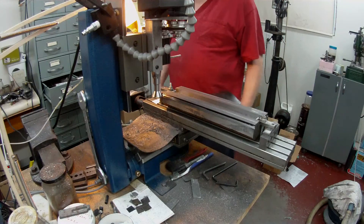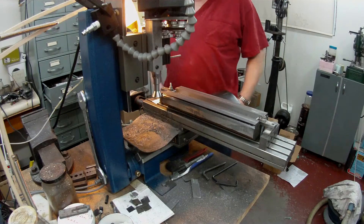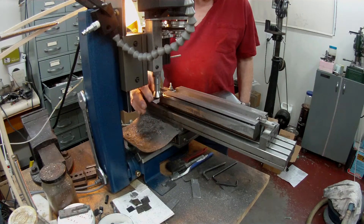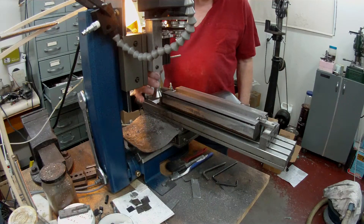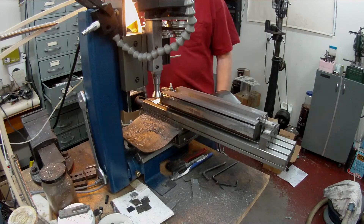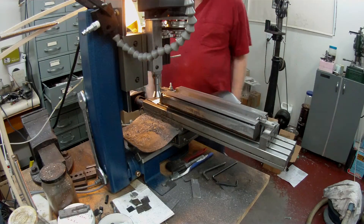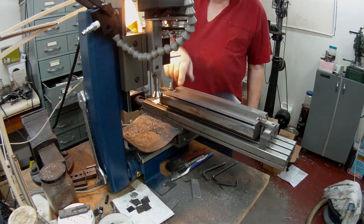Another day, and I did take the cutter out and put it on the lathe and relieved the diameter at the point where it was just touching — there was contact there. So I did that and I'm now doing the other side of the dovetail, and I've got my Z axis zeroed so that it will be the same as this side.